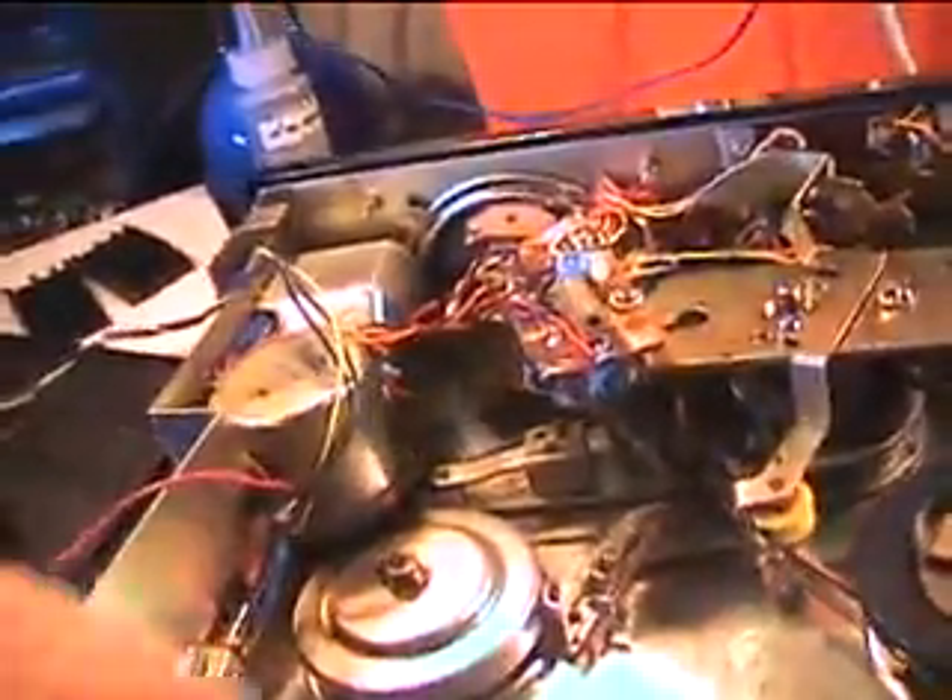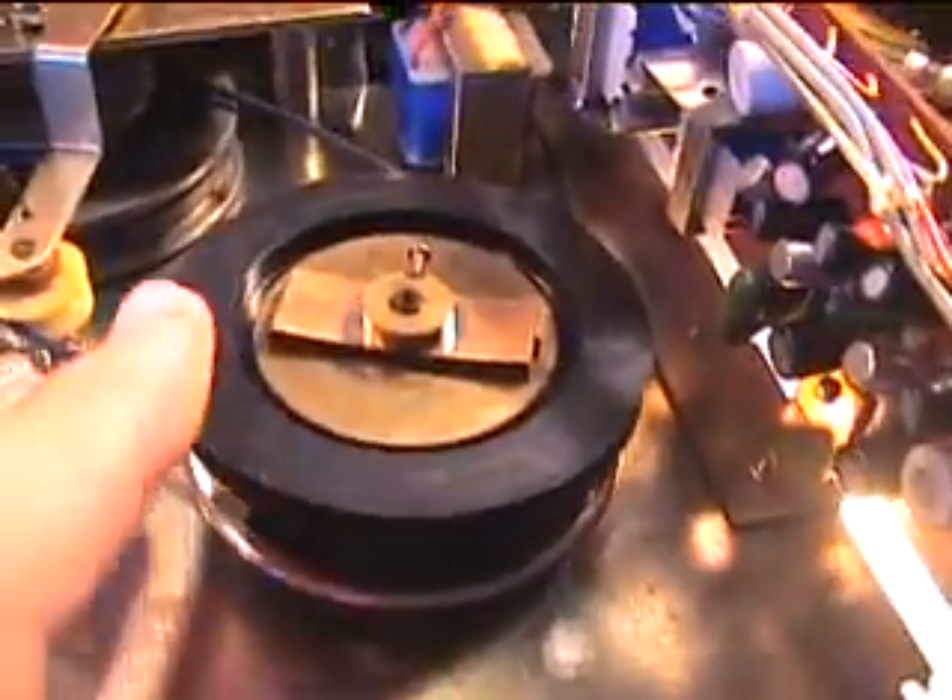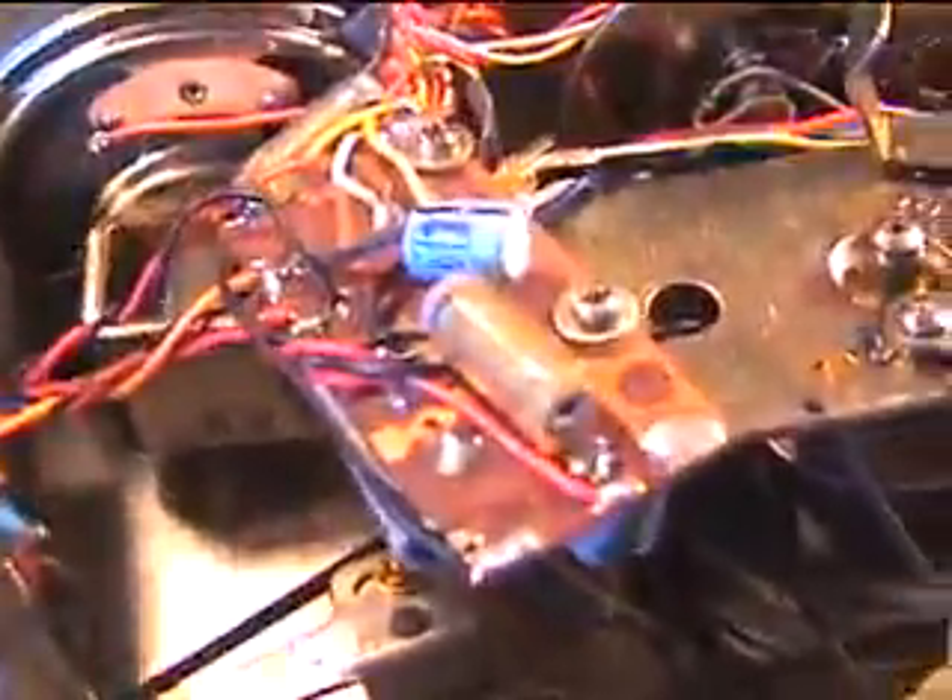The inside of the Phonola Magna Chord is very neat. I have been able to move the motor up a little bit to get the belt on there tighter. I can't find a belt exactly that size. There's a six-transistor circuit board — five transistors in the amp and one transistor for the AC bias oscillator. There's also a capacitor and resistor.